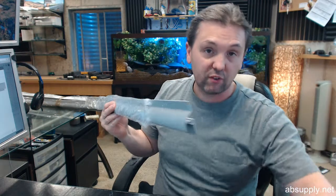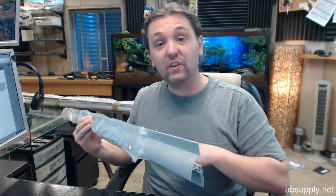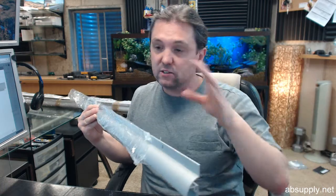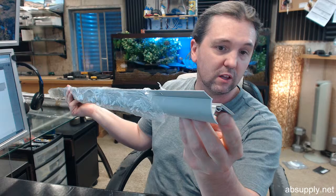We mentioned the different finishes that it's available in. You're going to use this in any exterior application. If it's an in-swing door, you're going to have to notch the drip cap back around your stops. That's not uncommon. If it's an outswing door, you won't have to do anything, naturally. It is common that the vinyl runs a little bit long, and when you get it, it will be a little bit long for you to trim. That needs to kick out a little bit further than the net door width, of course, to give you a better seal down there.